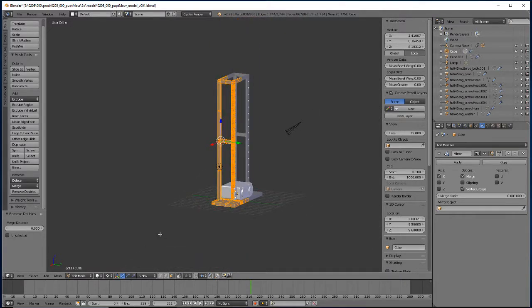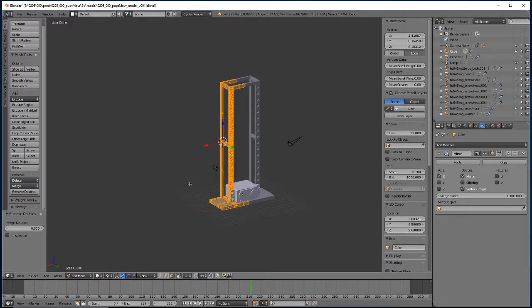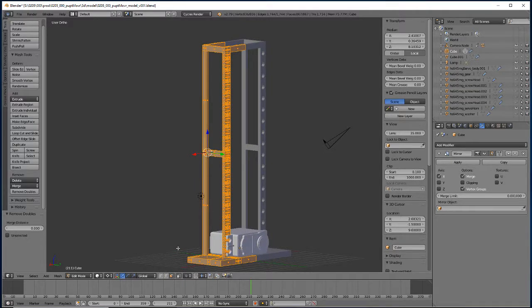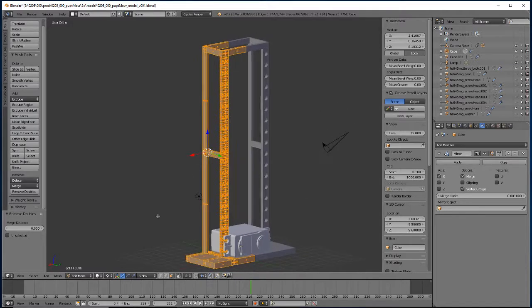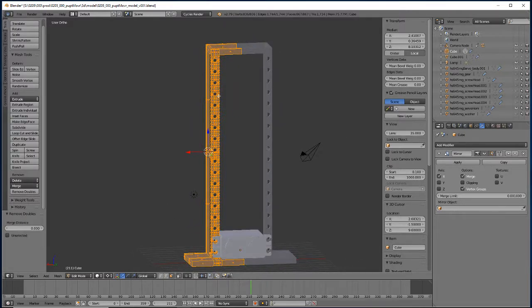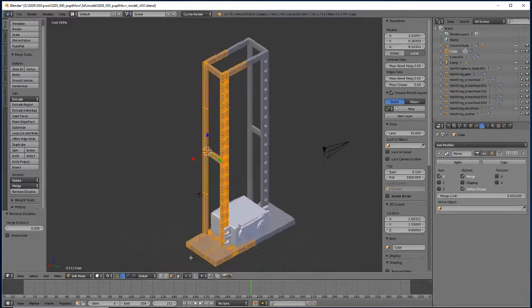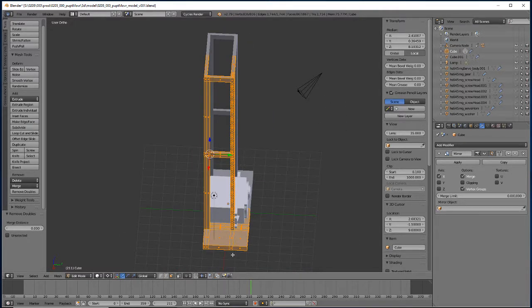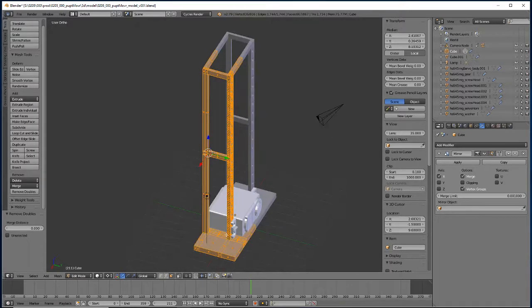Now, is this conducive to the most easily 3D printed part? No, it's not, but it's at least getting an idea of how we do it. Maybe these are parts that we print out and then glue together. I don't know. Because there'd be a whole lot of support in here, in each of these holes, and getting those holes right would be tough. In some ways it'd be easier to trim this off here and have the supports on the bottom and build it up this way.